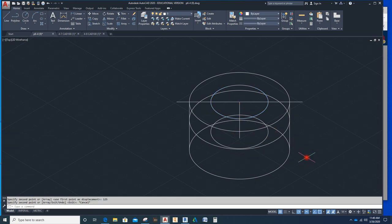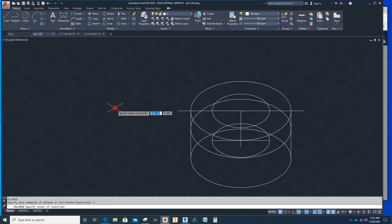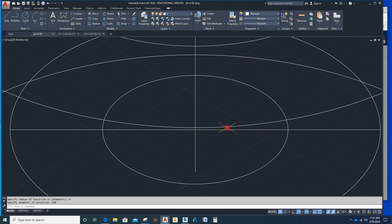Okay. Now the other thing I can do, find the center line of that one, and then at that point, I can draw the 100 diameter. So, ellipse, down arrow, down arrow, isocircle, center, it's right there, diameter, 100,